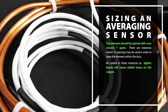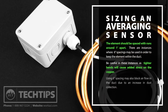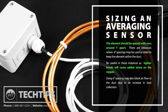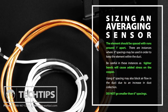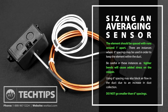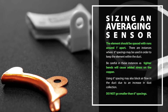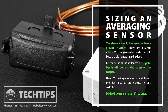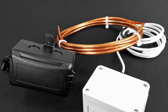There are instances where you may need to use 6 inch spacing in order to keep all of the element within the duct, but be careful as the tighter bends will cause added stress on the copper. Using 6 inch spacing may also block airflow in the duct due to an increase in dust collection. Do not go smaller than 6 inch spacing if possible. The sensor mounts in a serpentine fashion, back and forth across the cross section of the duct, supported at each point it meets the duct. Make sure it covers the greatest surface area of the duct to ensure you get the most accurate possible reading of stratified air.